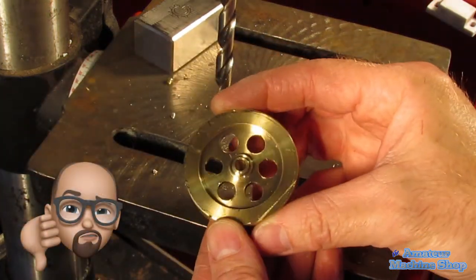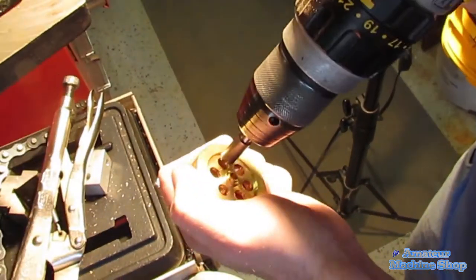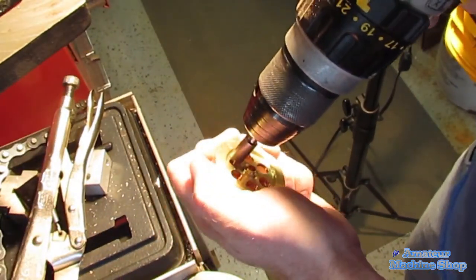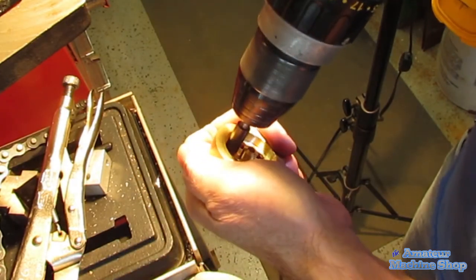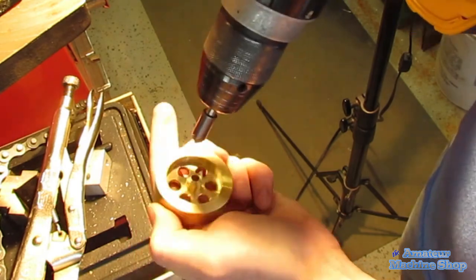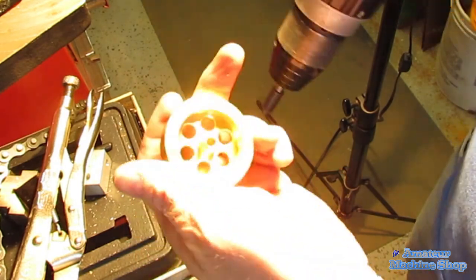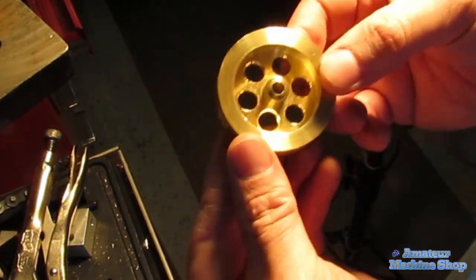Due to the flywheel being thrown from the drill press, I will have to take a few light cuts on the lathe to all the damaged surfaces to bring back the nice machined appearance. All the holes were chamfered by hand, and I will address the surface cleanup and polishing at a later date. One thing missing is a 3mm set screw hole to mount the flywheel to the crankshaft. I may have a set screw that is small enough that I can steal from my 3D printer projects.